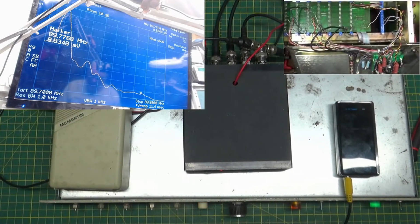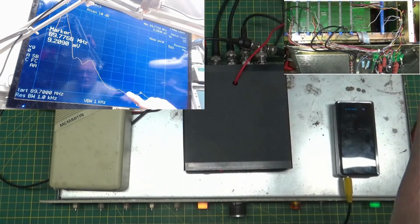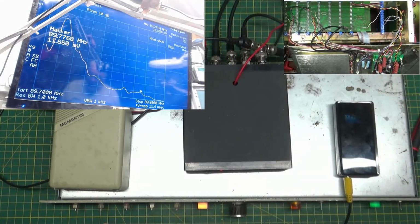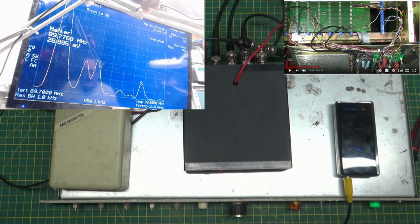So we are doing well. We've got an SCA receiver and a little cheap transmitter, which I was really quite surprised that this thing would even work, that it would pass it, but it does. And you can see what it does to the spectrum analyzer, because I've got this thing video averaging out a lot. If I stop all the sounds coming into here, we're back to what looks like a fairly normal spectrum analyzer.